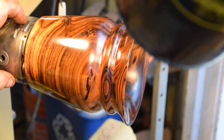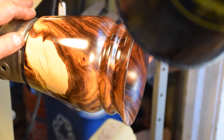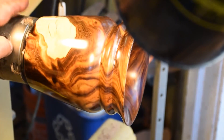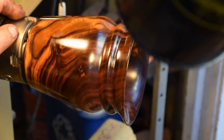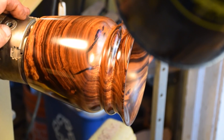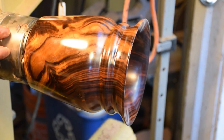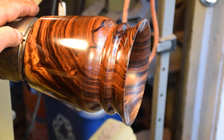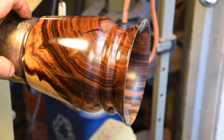I just finished hollowing this — did a couple more little finishing passes with the hollower, but my battery ran out and didn't catch that very end. Now I've got a nice interior on this piece. I'm going to do some sanding and then finish it. I have it sanded inside and outside right now up to 180. I'm going to go 220, 320, 400, and then I'll sanding seal the whole thing, and then I'll check back in with you.